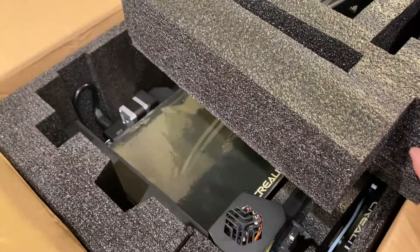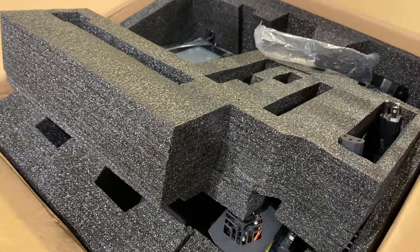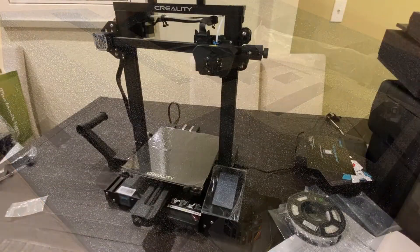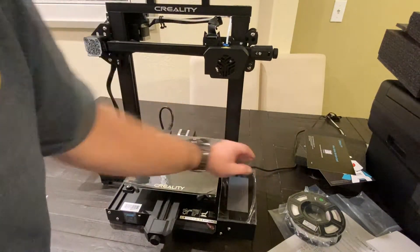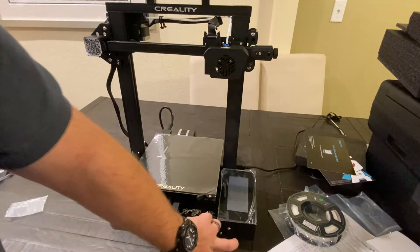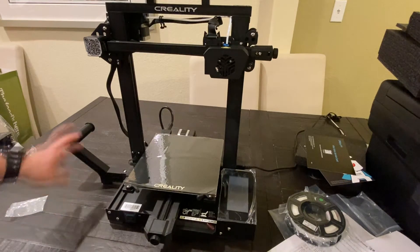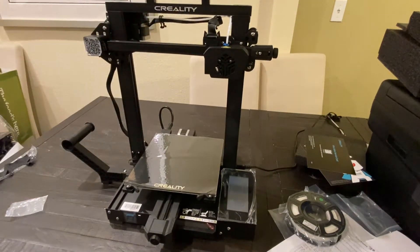As far as I understand, there's only a handful of screws to put the whole thing together. Here she is, fully assembled. The assembly process is pretty straightforward. On the gantry section, there are a couple of flats milled into the machine so you know that you're in the right place — it pretty much locks it in there. There's two screws on either side. On the screen, there's two screws that hold it to the body, one wire that plugs in from behind. The cable holder just kind of snaps in place, and then two screws and two T-nuts hold in the carry handle up top.